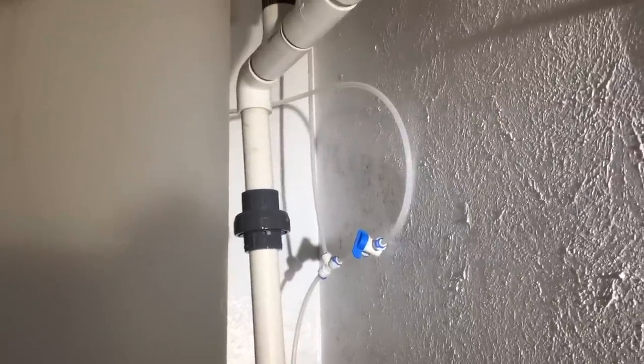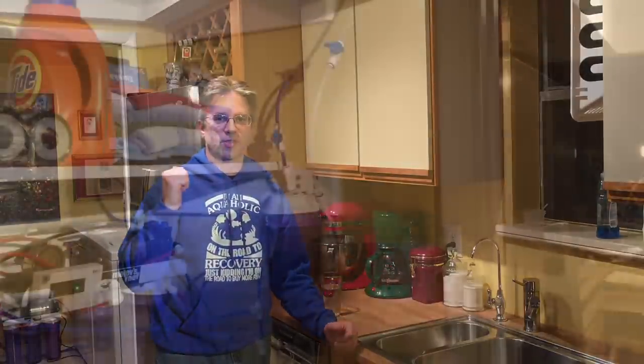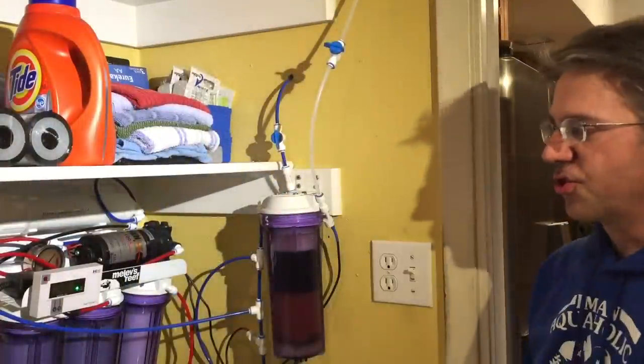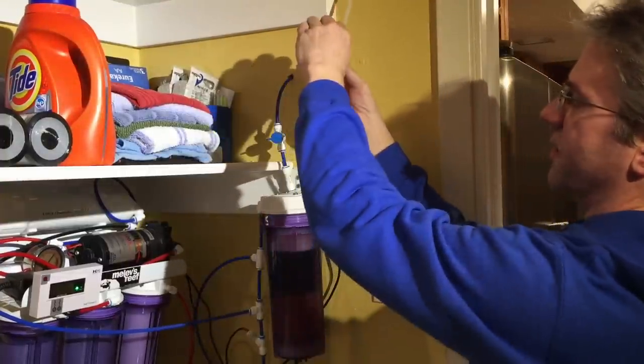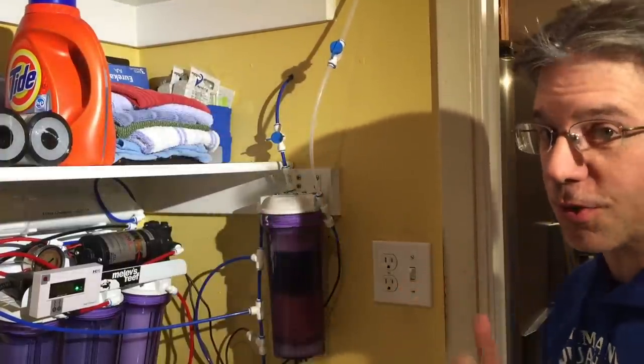When I add salt I have 250 gallons of saltwater. The other end of the tubing runs down the wall and across to the top of the container. By running the tubing through the walls of my house I never have to carry buckets of water anywhere — I do water changes into a drain, pump water through plumbing, and refill containers by opening and closing ball valves. That's pretty much it. The bladder tank is done now, so let's go switch the valves. TDS is 10 coming out of the membrane, so I'm closing the kitchen valve and sending water over to the reef tank — I need to open the valve at the other end as well.